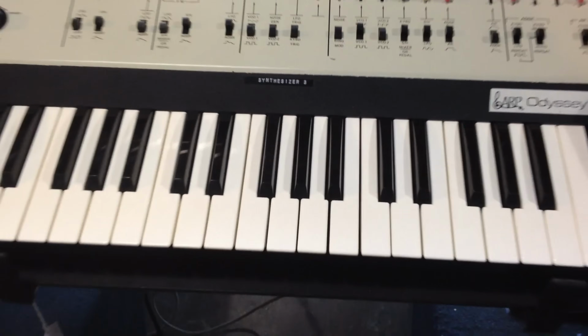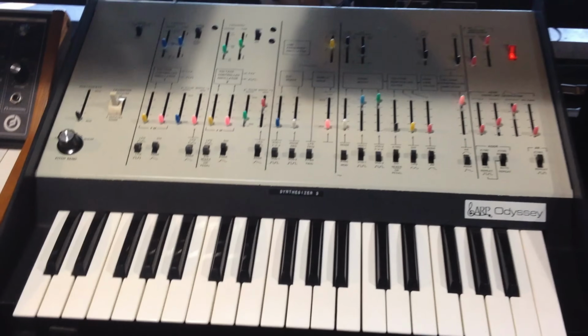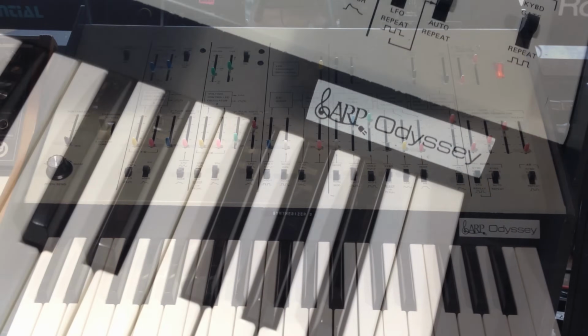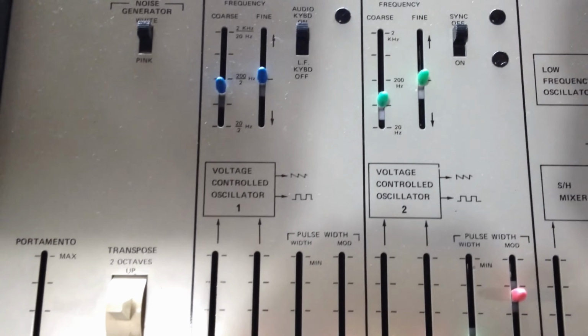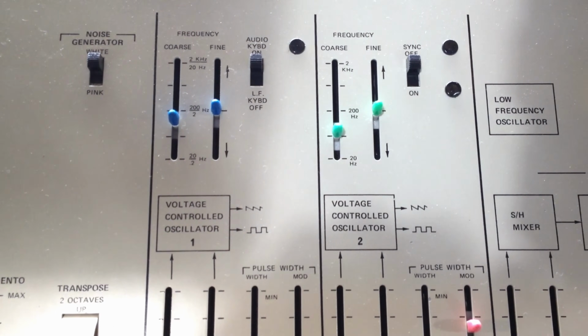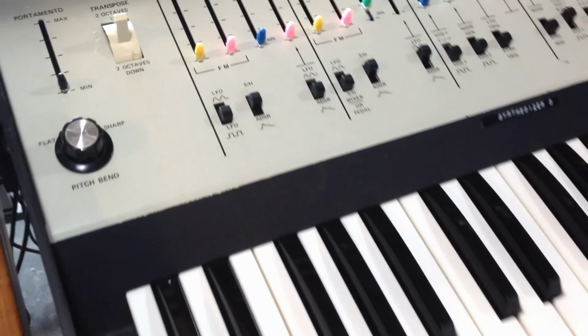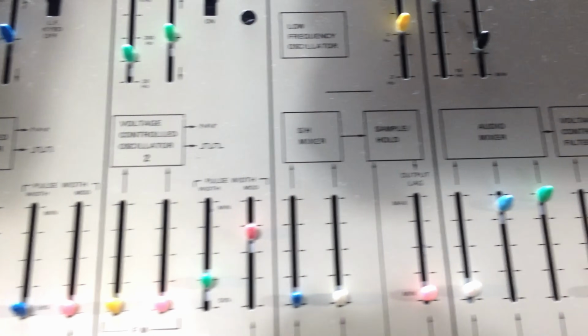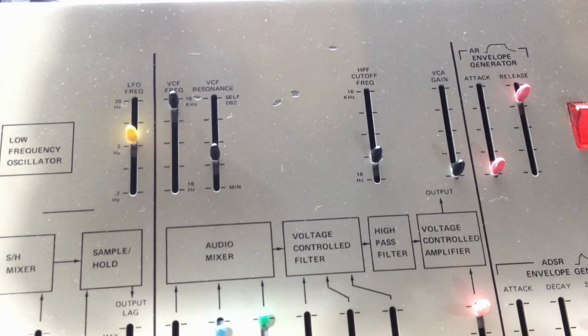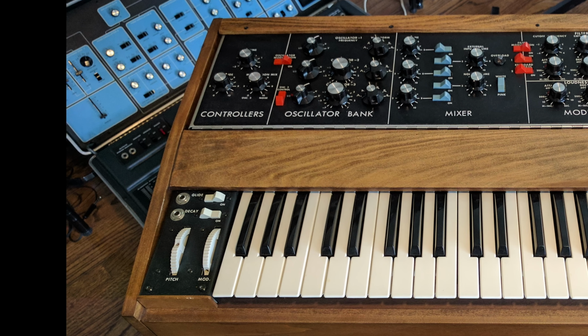It packed the sound and flexibility of the bulky 2600 into a portable two-oscillator beast, and it was wildly successful, so much so that over the next decade, Arp ended up making 3 versions of the Odyssey, with several different filter designs. The Mark I Odyssey is commonly called the Whiteface, and with its oscillator sync, pulse width modulation, ring modulator, and extremely stable tuning, it offered fierce competition to the 3-oscillator Mini-Moog.